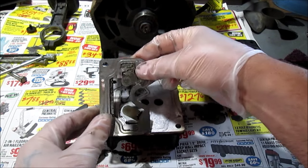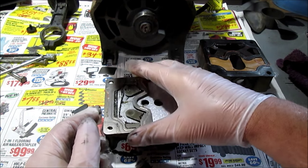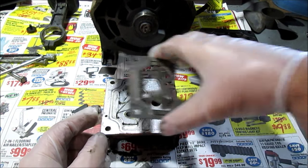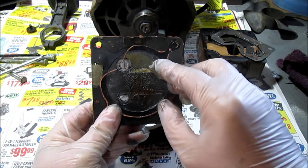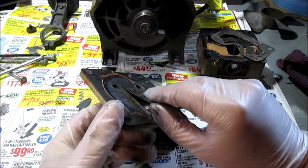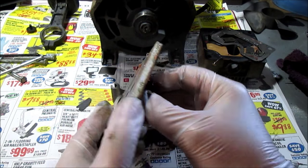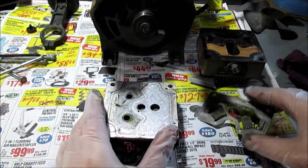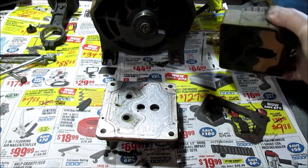Notice here you've got two flappers. These flappers are made to go up. So when the piston pushes up, it's going to open these two flappers and push air in here, which pushes it in the hose, through the tank. Here's how it works on the bottom — when the piston comes up, this opens right here. This opens when it sucks — that'd be your intake stroke. It'd suck air and pull this flapper open. Then when the piston comes up, it would push it shut. The air can only go through here, push through these two holes, up into this chamber, out to the tank.